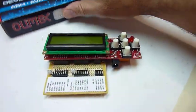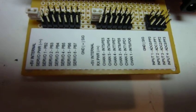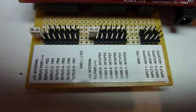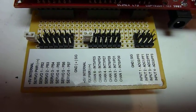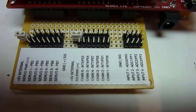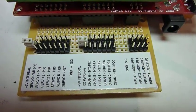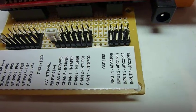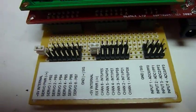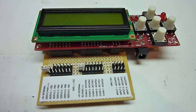Now we're ready to play with the controller. On here I have six servo outputs — I could have many more, as many as the available pins. I have six channel RC channel inputs, and I could have up to eight based on the number of interrupts available. I've also pinned four of the ADC inputs out. There are many more pins available; I just thought those were good for my use.